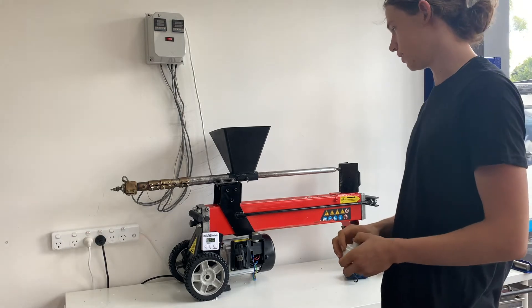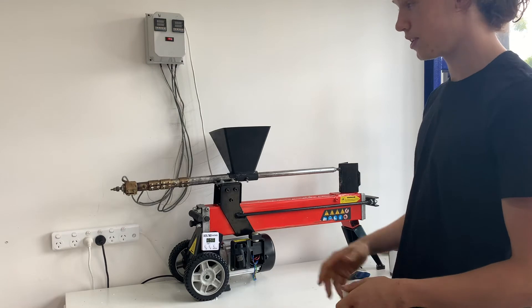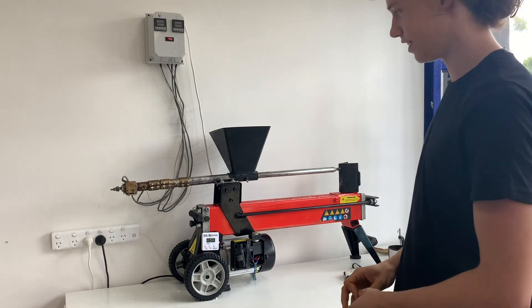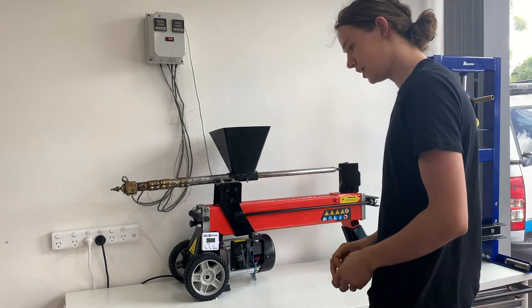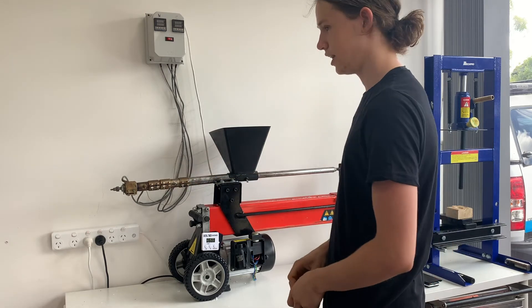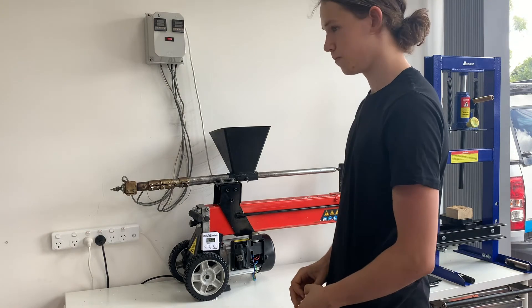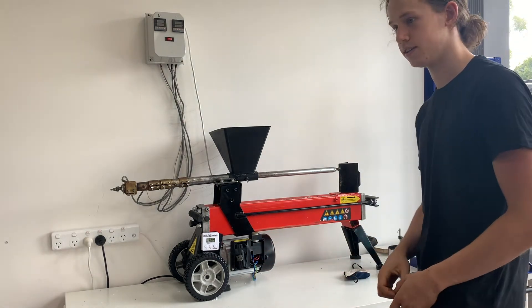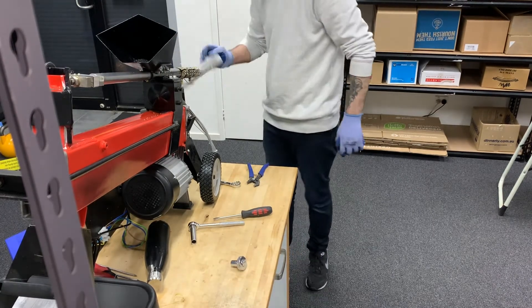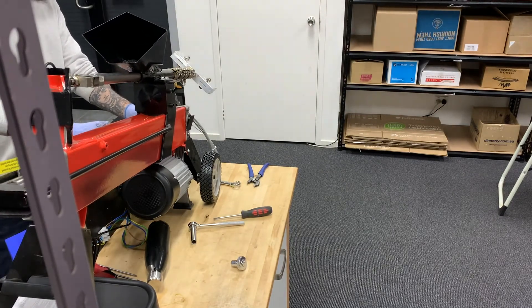If you're thinking of upgrading to the log press injector, there are a couple of safety things to keep in mind. Because it is five tons of hydraulic pressure, it won't stop unless you tell it to stop. If you're not careful you can over-pressure moulds, you can over-pressure the nozzle, and you can cause a lot of damage very quickly if you're not paying attention. Make sure that your moulds are secured properly. You can get away with loose bolts on a manual machine because it'll fail relatively non-violently, but on this machine you have to really watch out for it.